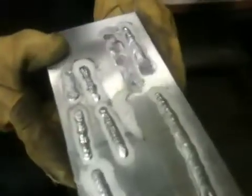And then you have stuff that looks like something like this where it sits up too high. That's called a cold weld, so there's not enough amperage there, and you need to be putting some more into that.